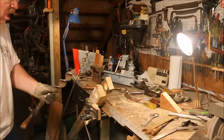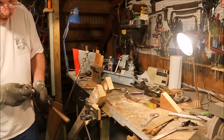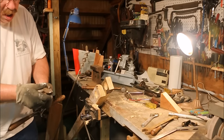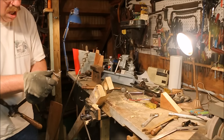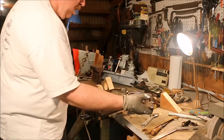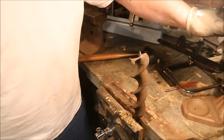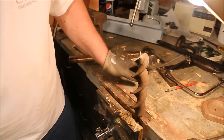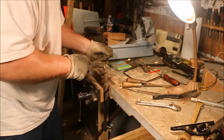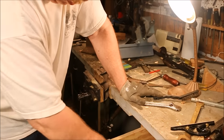Still having problems — still pulling out after just 3/8 of an inch of entrance. The radial edges just aren't biting in and the screw isn't strong enough to pull the radial edges in. When I look at the back edge, I can see that the wood is actually polishing the face of the auger bit — it's rubbing right behind the cutting edge. That tells me I've got a problem with the relief angle.